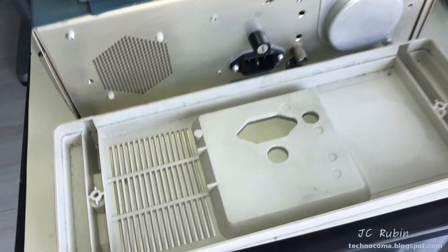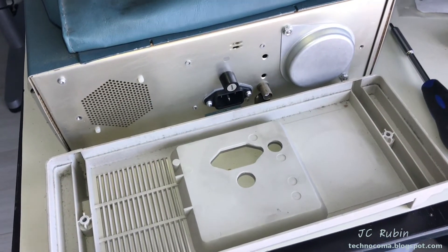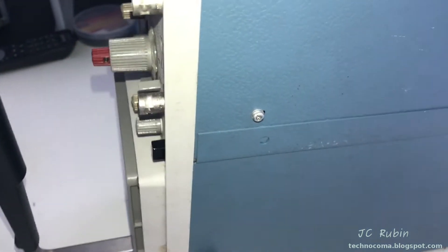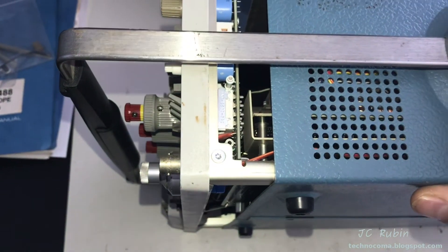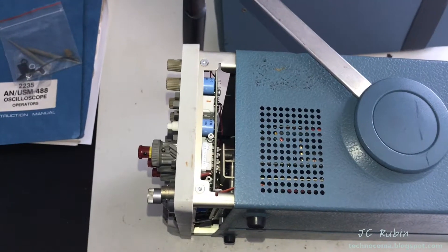The removal of two screws on the plastic cover releases the back shell. This thing was designed for service — it's very easy to work with. Another screw that secures the oscilloscope into the chassis is found on the underhousing forward of the whole unit, followed by the singular side screw on the rear. At this point the top piece comes right off — it's held in by pressure and slides in the mechanism. Push from the back, the oscilloscope slides forward, and this bar will have to be adjusted so the scope can come out of the chassis. Then it's just pulled straight out.